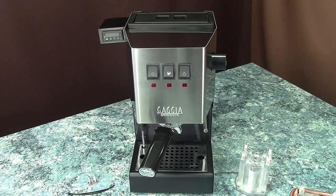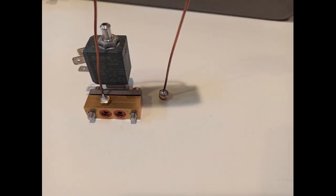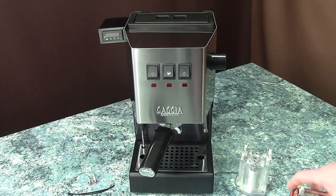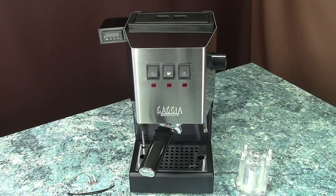What are the system requirements? The classic must be PID controlled — and I mean both brew and steam temperatures — because the steam thermal well needs to be partially removed, so there will be no room to fit the steam thermostat. The small solenoid coils, 30mm in height, 22mm depth, and 28mm width, rather than the bigger one, or a pressure gauge tapped in between the solenoid and the group head from BrewBetter, myself, or from Shades of Coffee. This is necessary to position the solenoid coils further away from the boiler. I can also provide a spacer to overcome this requirement without fitting a pressure gauge or the small solenoid coils.